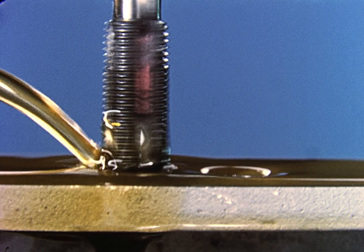But, of course, there are times when a very special tap is the only solution to a difficult machining problem. Even so, increased tap costs are more than offset by the increased production they make possible. For example, a pump manufacturer wanted a tool which would tap three concentric holes in one operation. This special tandem tap was designed to cut one-inch twelve, one and an eighth inch twelve, and one and three-quarters inch eleven and a half threads in one pass. This tap more than made up for its higher initial cost in higher production on the job.